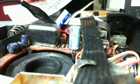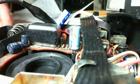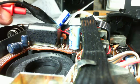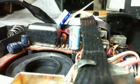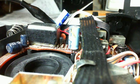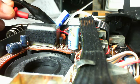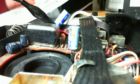So the voltage should be 4.5 volts. Okay, settle that down. We should see 4.5 volts across this capacitor. And what we actually see is, I see nothing at the moment. What happened? Here, my negative clip lead came off here. Oh boy. Sit there, please. Here we go. 5.6, which is the supply voltage.